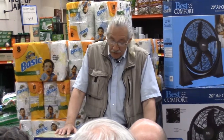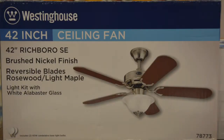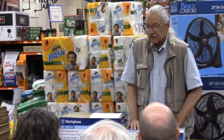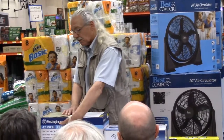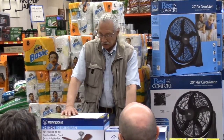There are basically two different types of ceiling fans. Number one, a downrod fan. Comes with a downrod, and that can vary in length. If you need a longer rod, you can buy longer rods. Sometimes if you don't want the rod, the canopy, in a lot of cases, can be bolted right to the motor, and that alleviates the rod. The other type is what's known as a ceiling hugger. All right, it's a much bigger base, but it fits up closer to the ceiling. So if you need that headroom for whatever reason, usually go with a ceiling hugger fan. If you have a cathedral ceiling, you'll usually be going with a downrod fan with longer rods. So those are your basic two types of fans that get installed.